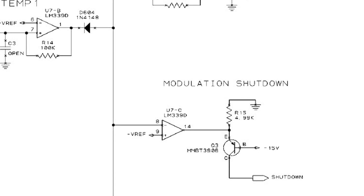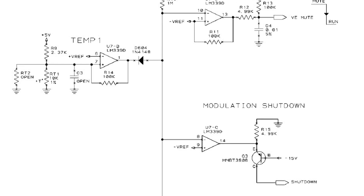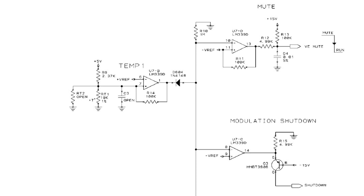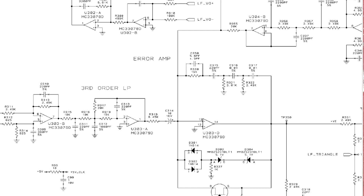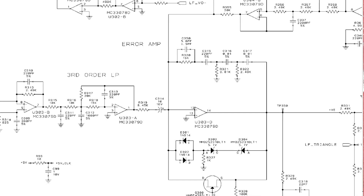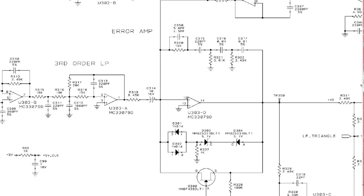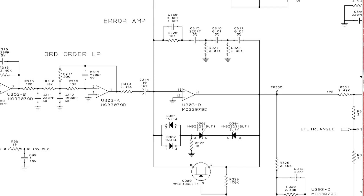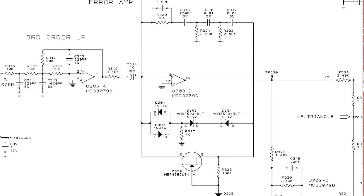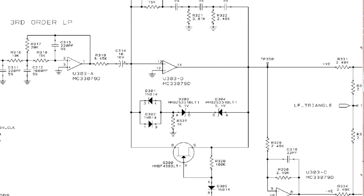This week I've changed the FQP17P06s and the FQP17N06s — complementary FETs in the output stage. They are arranged across the power supply rails in complementary pairs, and if you accidentally switch both on, or don't drive one completely off and the other one turns on, it just fries the transistors completely. You get the full 40 volts from the power supply dumped straight through a totem pole through these devices, and it fries them instantly.